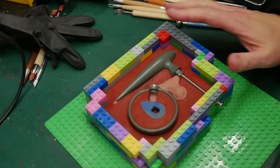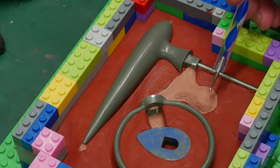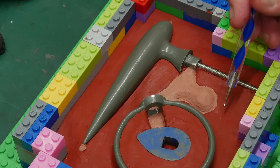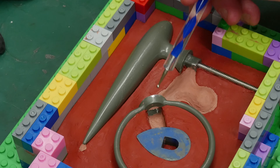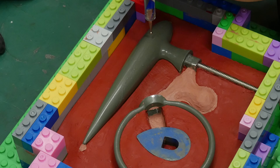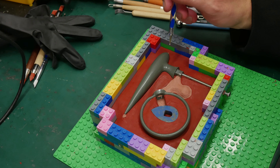I think we're just about done here. Got all the pieces cleaned up and put back in. I added clay filling both of the vent holes, and I filled the sprue — the fill point — and created a kind of a hump here, which would be a bit of a well for when you pour the metal in. This runs over here and through here and gates into the bottom of this part, the tip of the ring, and then into the side of the base. The only thing I missed was I should have had a vent on the other side of this piece at its high spot and a vent for this ring, but if I need them I can always pierce it later after the fact.